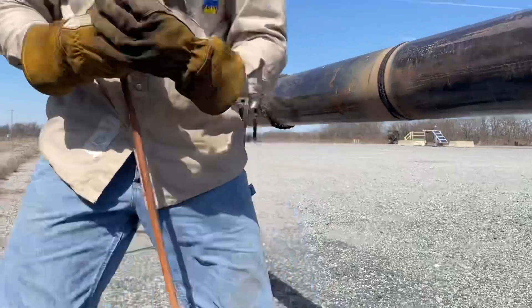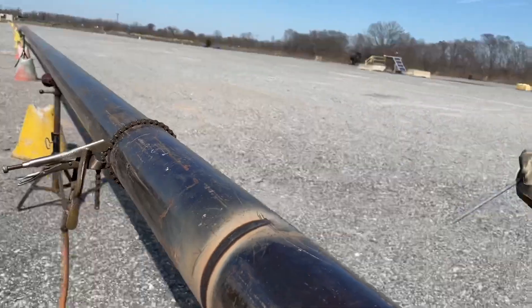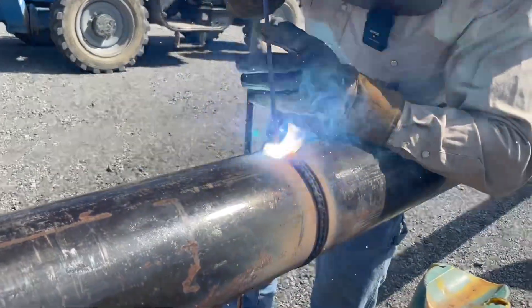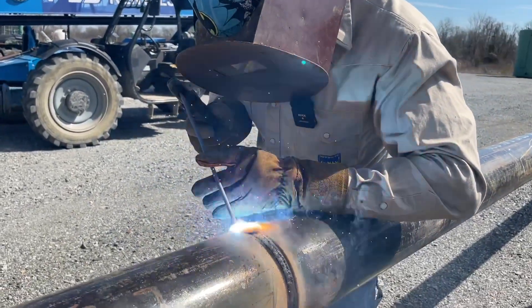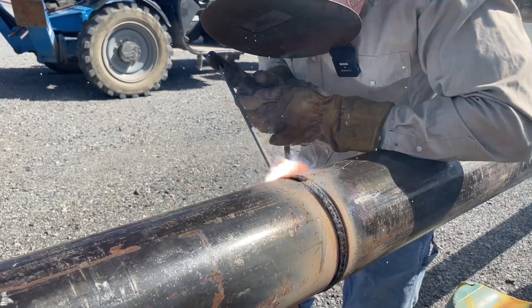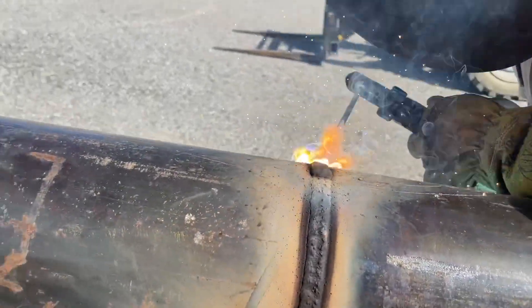Get all that baby. Got a little too much on the top — it's not a big problem, it just makes you run short at the bottom. Get on the side and gravity will start helping me. I could use two rods and pile it up there and make it look all pretty and high and tall, but that's not really the point — the point is to make a good weld fast and efficient with as little rod as possible.